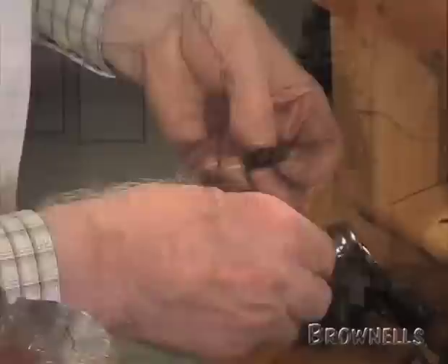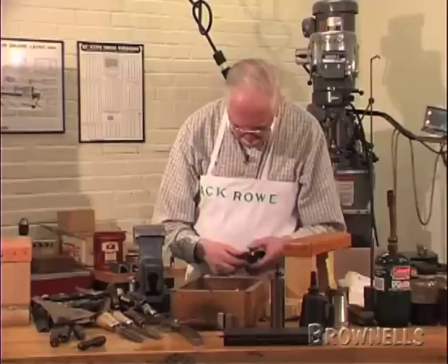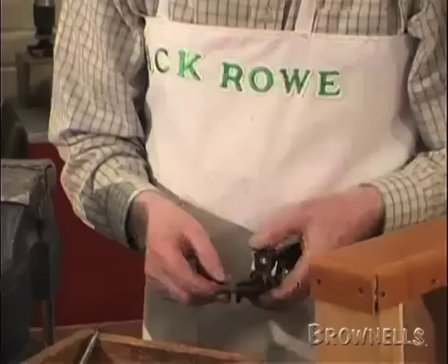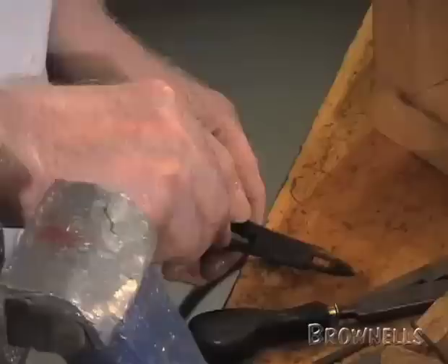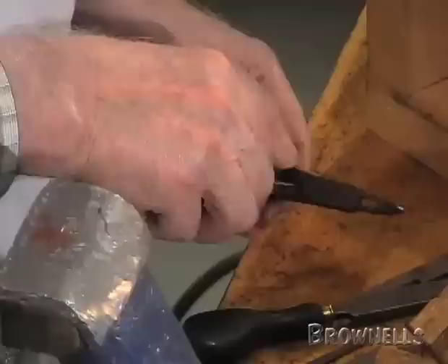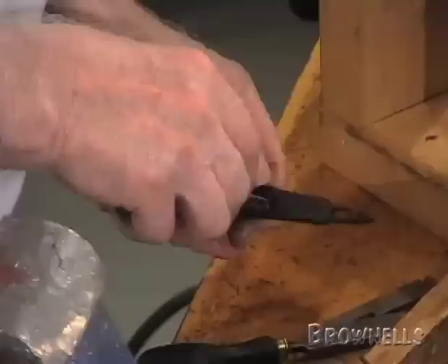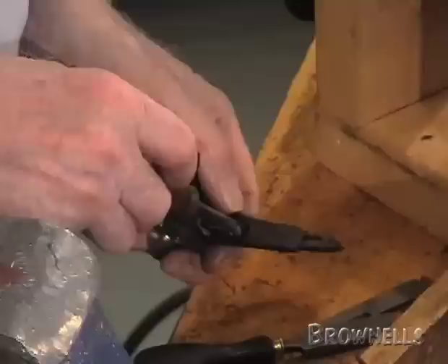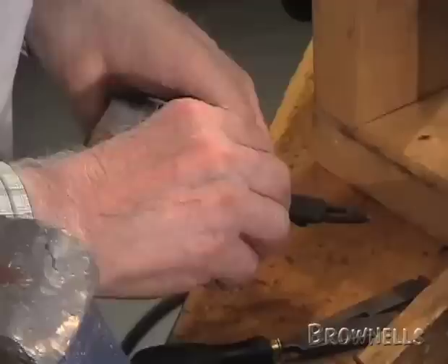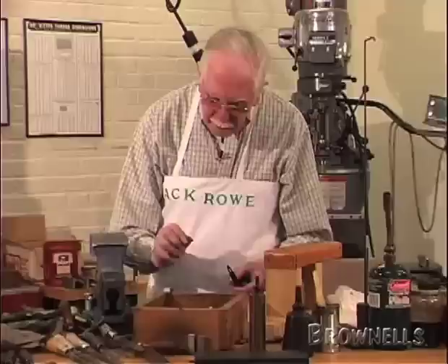Now there's the safety slide. And there's a little safety spring here, very much like the sugar tongue clip spring in the old foreends — it is a similar shape. I'll take that out. It's only a little spring, just over one screw. That's the safety spring taken out.